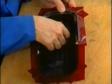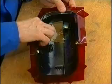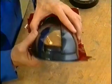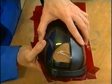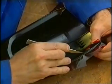In a first step, the mold-making process is prepared by determining the separation line and lining it with tape. All openings that could obstruct or even make opening the mold impossible must be closed using colored tape. It's worthwhile investing some time in this activity and working very precisely.